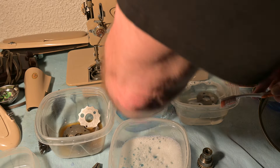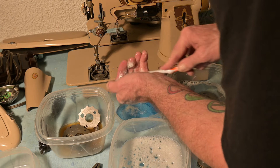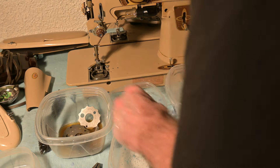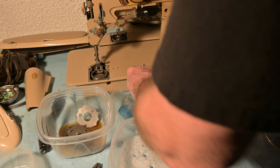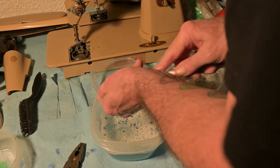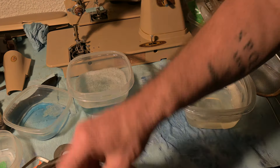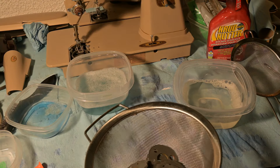Here comes the next disc — there are seven discs altogether. We scrub it up with pure dish liquid soap, then give it a scrub rinse with the watery dishwashing liquid, then throw it in the rinse. Let me get this little stud, this little post — the cam stack post — just to get the really obvious wet stuff off.